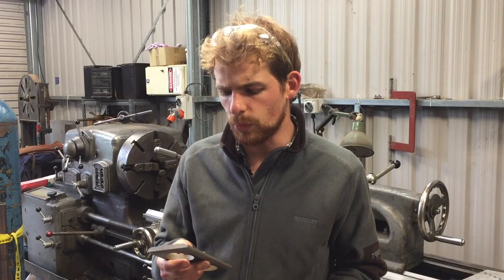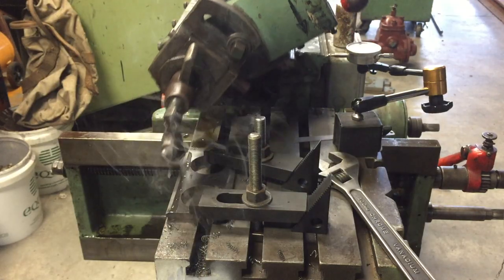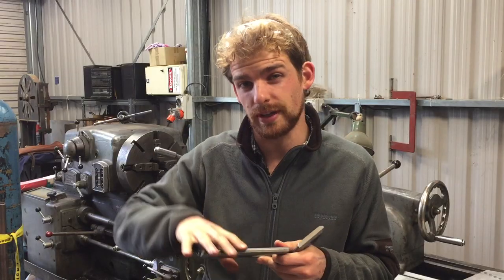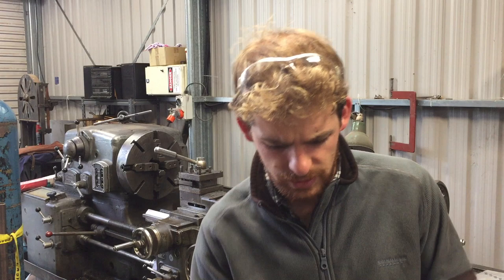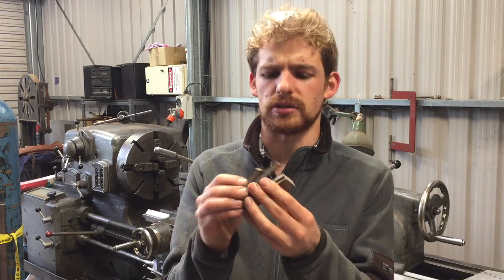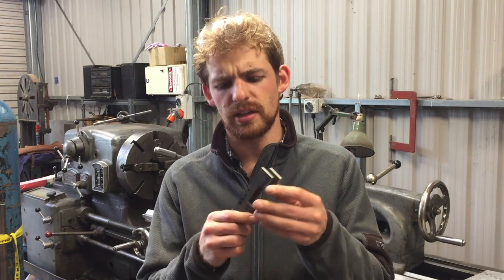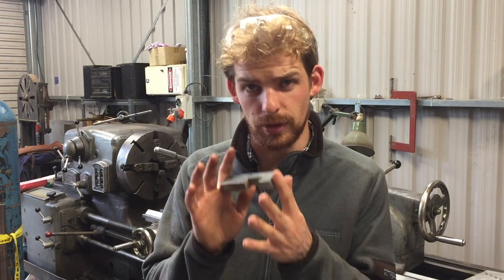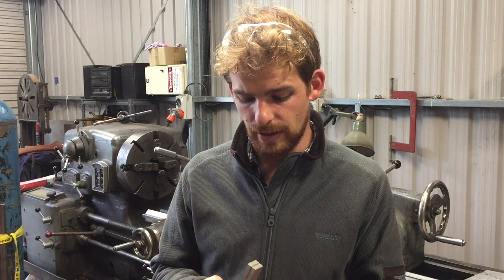In the last video we had a look at how I was machining the weld prep on the plates for the valve chamber for the circulating pump. Now I've got a whole lot of little pieces that I need to use the grinder for because they're just a bit fiddly for the shaper. There's some smaller but slightly heavier pieces, so I'm going to give the shaper a go again for these in the hope that it will at least save a lot of noise, if not time.